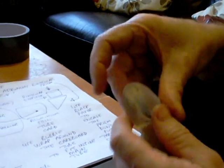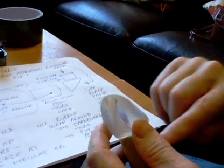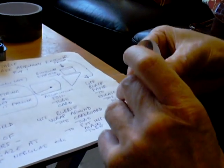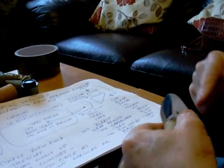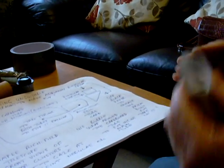You basically don't put tape on this, just put some paper around it. Black paper is the best. First, tape the black paper, so it's held by the tape on this side here. And you can put loads of tape onto this tube here to hold it, but don't put tape onto the actual prism. It needs to be free so that the light can hit the back, and you have black paper behind this.